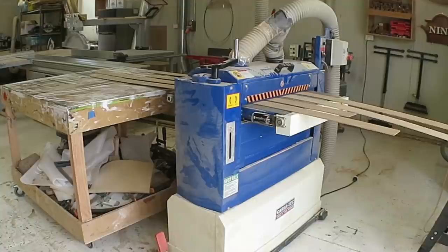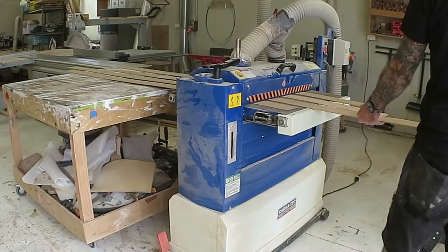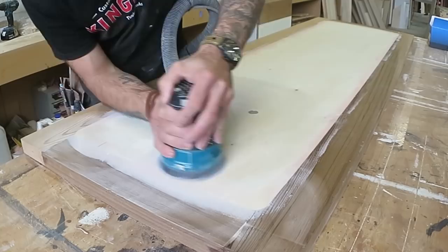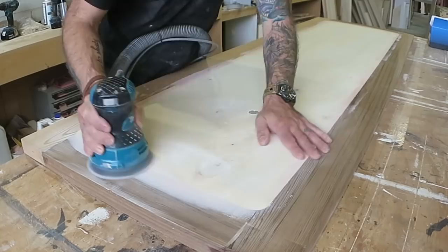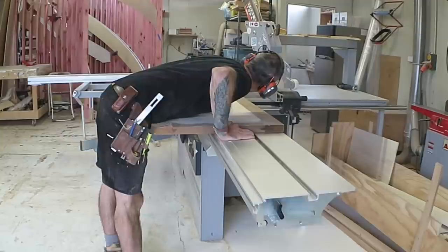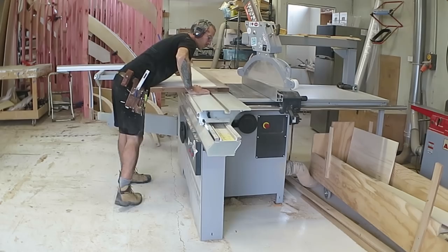I had a whole bunch of these oak strips going through the sander getting them all down to three millimeters, and also prepping the door blanks — filling any screw holes, divots, and dents, and creating a two-millimeter bevel on the two sides of the doors that open to each other, so I can get weatherproofing in there and so the doors won't bind on each other when opening.